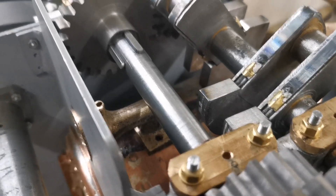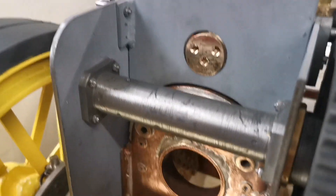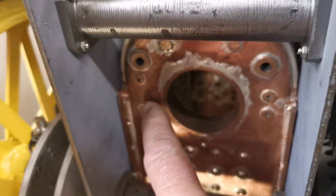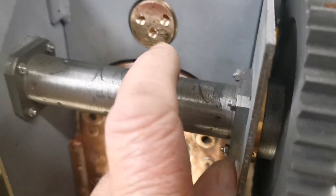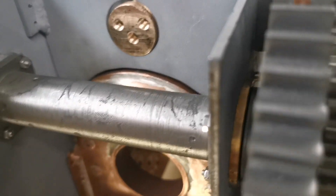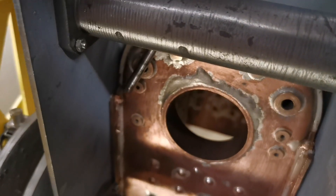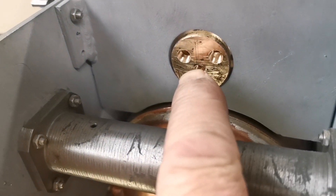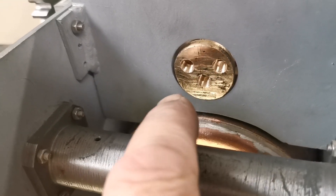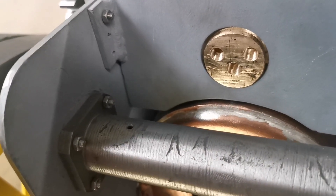As you can see I've just placed it in there — it'll be fitted on the boiler under there, and this is the output of it. That fits in there and that fits in there. We'll have a glass water gauge going up to those two holes there. That'll be a glass tube with connections on the top and bottom going to the manifold, and from that bottom hole there it'll come out with a bend, go to a ball valve which then pipes run into a connector plate.